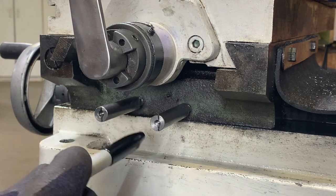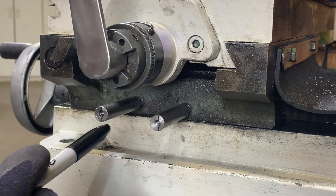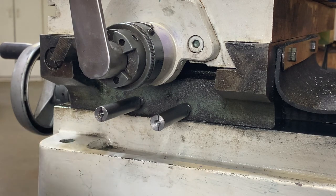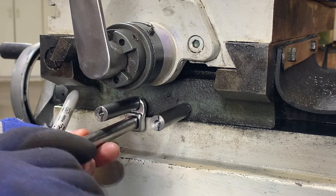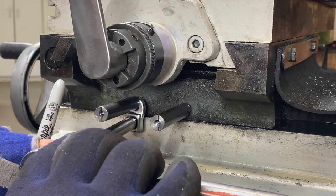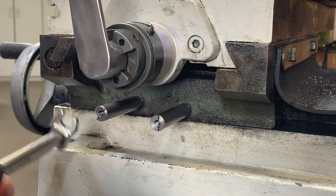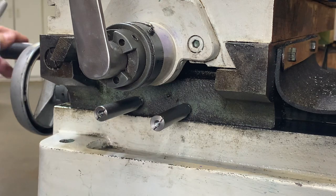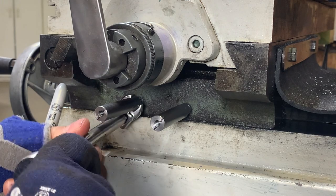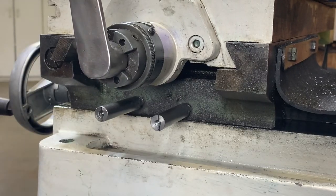I've screwed them in and already attempted this, so I know where it's going to go. I made a couple of vertical marks where it still turns but doesn't take a whole lot to get tight. The whole idea is that once you put those pivots in, you're only going to get about a movement from 12 o'clock to 2 o'clock on a clock. Imagine the connecting rod going like this — it's not going to go that far. When I bring it to the tight position I'm nice and tight on the handle, and at 12 o'clock I'm able to move the axis freely. That's what you want.